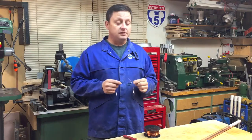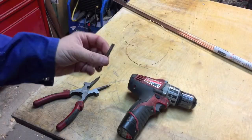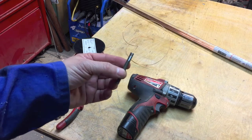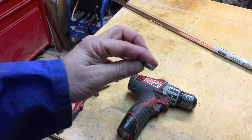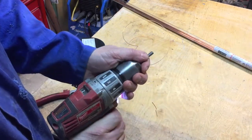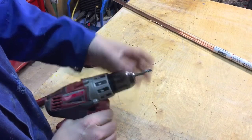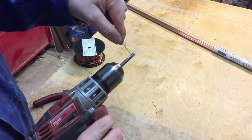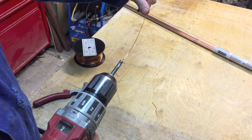So I have found a simple solution to straighten it up and I'll show you what I do. What I got here is I took a piece of quarter-inch round stock, drilled a little hole through it, put a little slot in there, then chucked that up in my drill. Then I take the wire, put it in there like that, and put the other end into a vise.